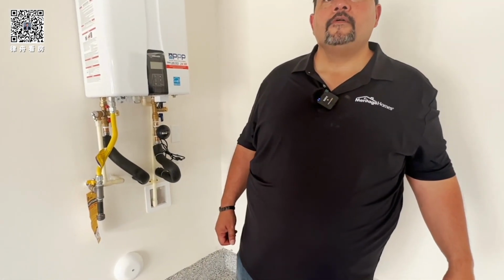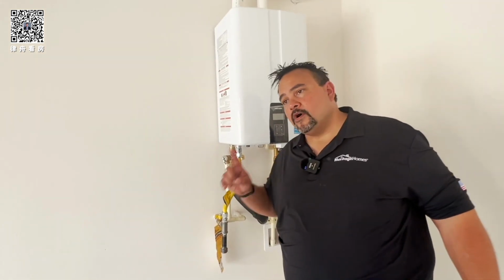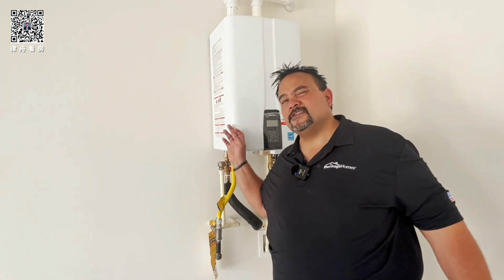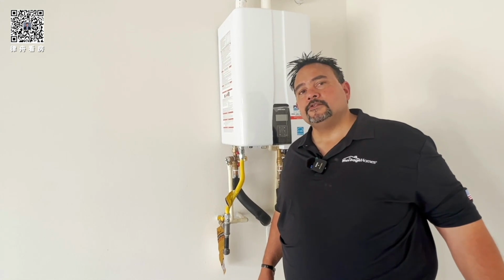What if he installed a water softener? Water softener, that cuts down your maintenance dramatically, right? From once a year, now you only have to flush this thing out every 4 to 5 years. Okay? So you can do that too.